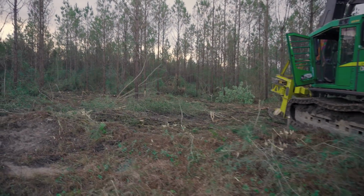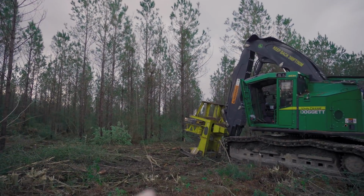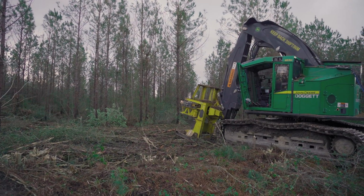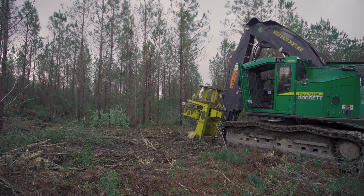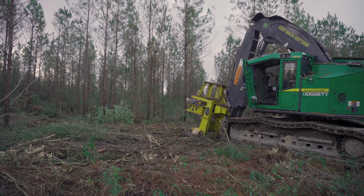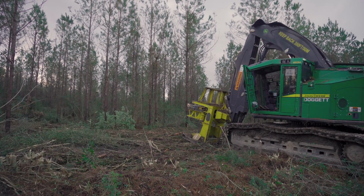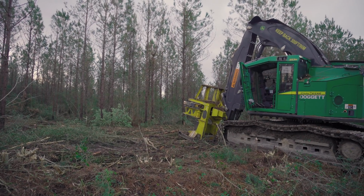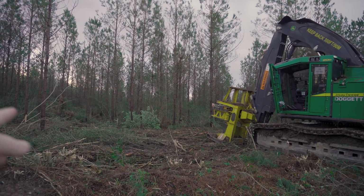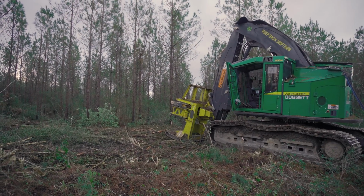And we'll step over here and show y'all this. You can see just over the head of the cutter right there is one of the, we call them down rows. Same thing as second thinning, but this being a first thin, so this stuff has been planted 12 to 14 years ago. This stuff here I think is like 11 or 12, and so it's not been touched in just basically 12 years, we'll say for video's sake here. And what you do is you count, 1, 2, 3, 4, and you cut the 5th row. It's called a 5th row first thin.